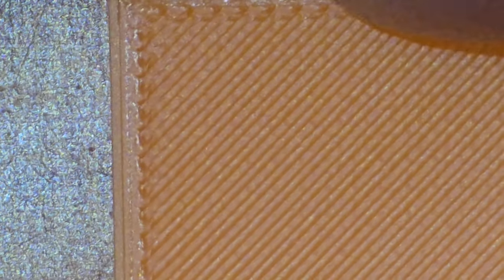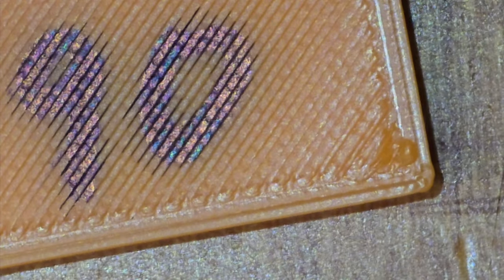I went all the way down to 90, but you can start seeing extrusion issues pop up at 93 — this is going to be under extrusion. You're going to start seeing little gaps show up. At 92 it's definitely passable, but you can definitely see the lines are further apart with more shadowing. And here's 90 — you can really see the exaggeration of the under extrusion. Throughout the board there are issues; there are places that are nice, but some places that are not.